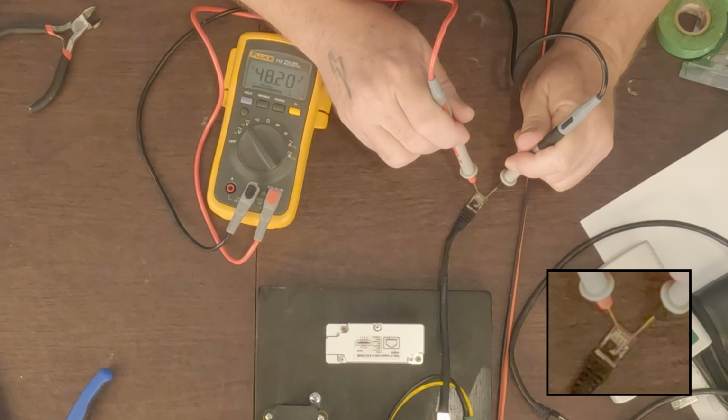So our next step here then is, oh, and we also got to check our switch lights up properly, and I did put a 15 amp fuse in here as well prior to this. So I turn this off, and the next phase of the test will be to actually run the dish and plug in the router and see how this is working.